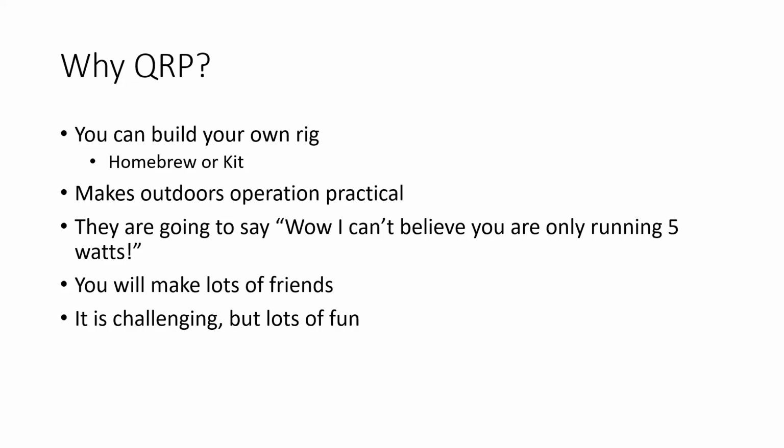I started off as a novice, and I had a 100-watt rig, and I used 100 watts. But I started backing off on the drive a little bit on the HW101 Heathkit, just to see what happened. When I dropped it down to about 75 watts, no big difference. I said, well, let's go to 50 watts, and no big difference. Let's go to 25 watts, and no big difference. I kept going down, and I discovered that if I just barely tickle the amp meter in that rig, it would still make the contacts. Now, as you say, it was CW, which makes, I think, a big difference. But it was amazing to me how low I could go.